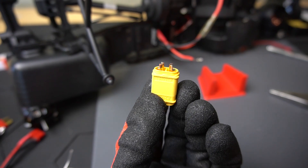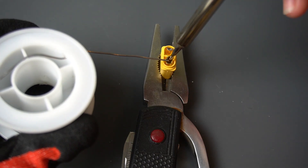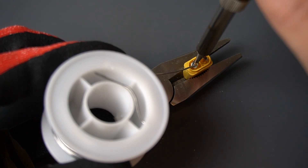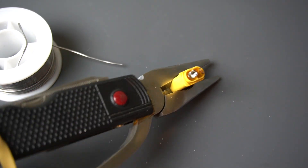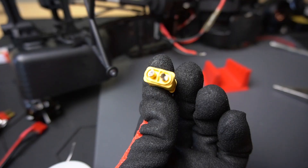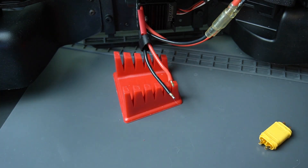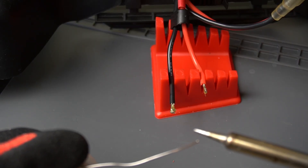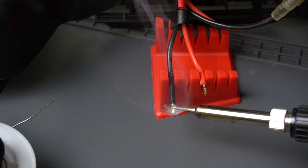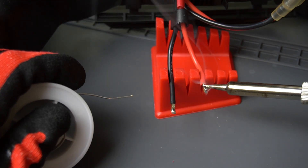For the connectors, our goal is to fill up the little cups with solder. With your iron in your dominant hand and the solder in the other, apply a little solder to your tip, touch it to one of the prongs, then feed in a little bit of solder into the tip. Hold the iron in place and let the solder melt into the prong. It should look nice and clean. Repeat for the other side. Now we'll do the same steps to pre-tin the cables — apply some flux, secure your cables in the holder, add solder to the tip, touch the iron to the cable end, and feed in a little solder, holding the iron in place to make sure it melts completely around both sides of the cable.